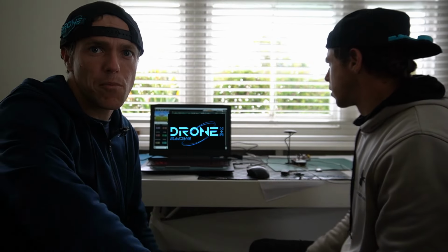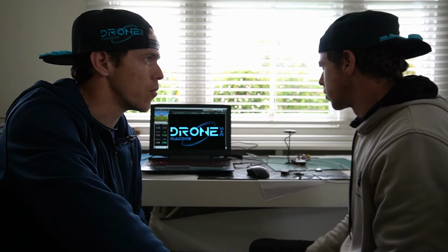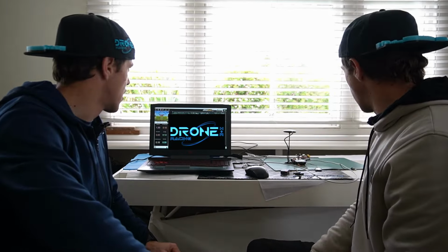In our case, I think we use a Pixhawk 1. And it was a 4.5.6 stable. Run that and then halfway through its download, it asks you to unplug it. You do that and then just follow the on-screen directions. Plug it back in and it detects it, and you're good to go. Yes, so here we go, and there you go, it's working. Okay, so what we do now is we'll jump back over into the workshop and install it.